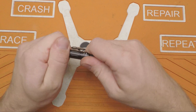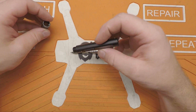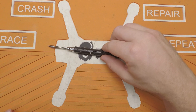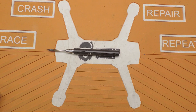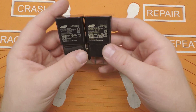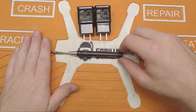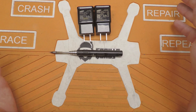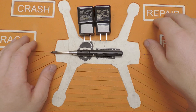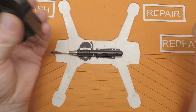Since I've always got a USB-C cord with me, it's super convenient. Whereas with the TS100, this barrel jack is the only one I've got — if I lose it, it gets damaged, or I forget to put it in my backpack with my soldering iron, I'm done. Look how small the TS80 breaks down — if you're really crunched on space you can take the stand off and look how tiny that is. There are some things to note about power requirements: you have to use a QC 3.0 compliant power brick. It needs nine volts at two amps. If you try to run this on a standard five-volt power brick, it doesn't work. It is open source, so maybe someone will come up with firmware to allow it to work at a lower output, but right now you need a QC 3.0 power brick.